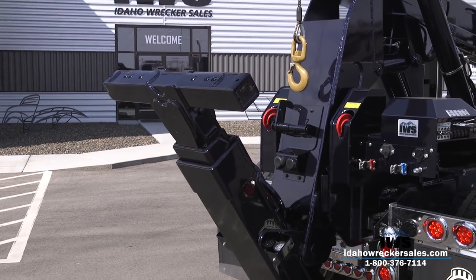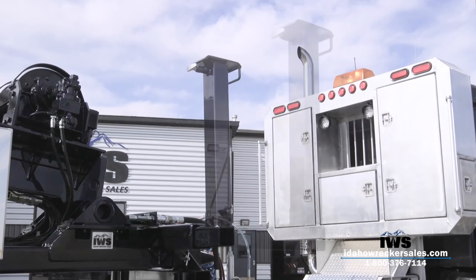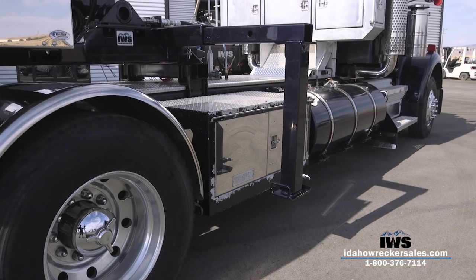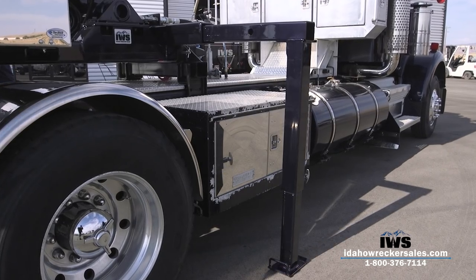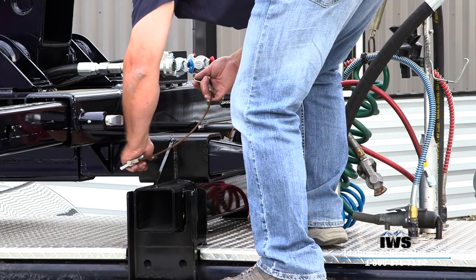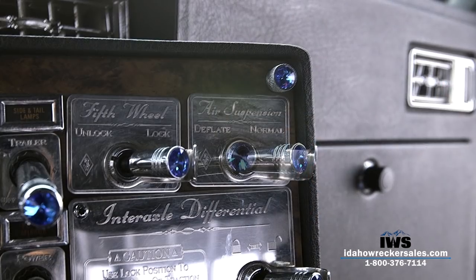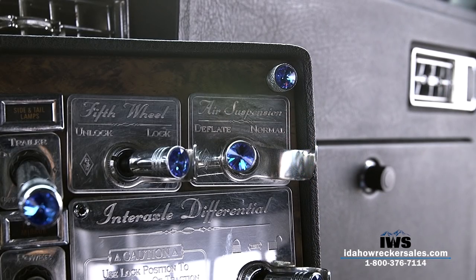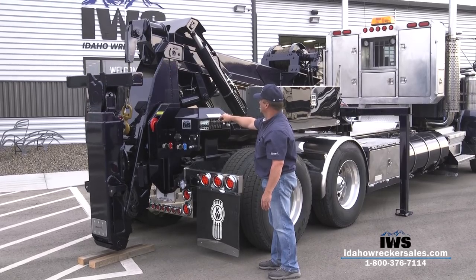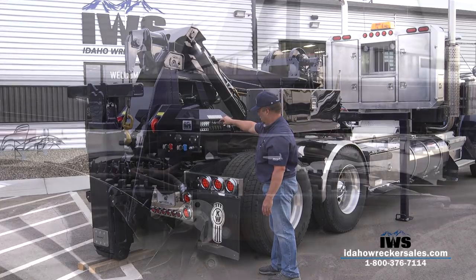The best part of the Holmes DTU is how simple it is to separate from the unit. The first step is to position the front outrigger legs — these will support the unit from the front end and are used when you need to detach the unit. Pull the pin on your fifth wheel, release the pins on the front mount assembly, and then deflate the rear suspension. This lays the weight on the front legs.